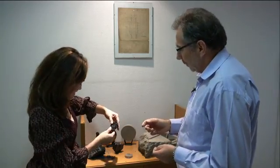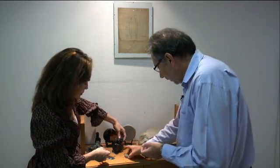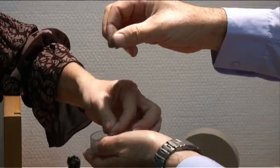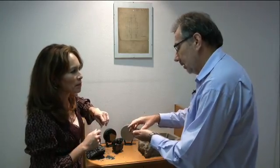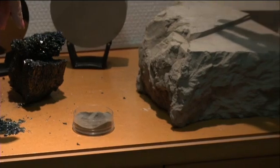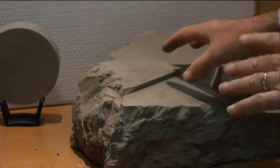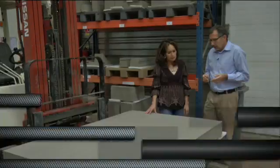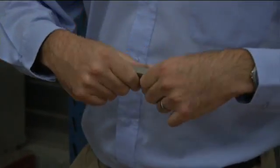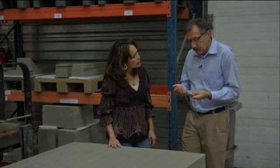No. In fact, for NIRSPEC we have to crush this into fine powder — typically one micron in grain size. Is this the stuff then that goes into making NIRSPEC? Not yet. There is a further step where we press this powder into blocks. We have just got the blank for the NIRSPEC base plate. This material is still very brittle and it feels like chalk or chocolate. It can be easily machined because the material is soft.